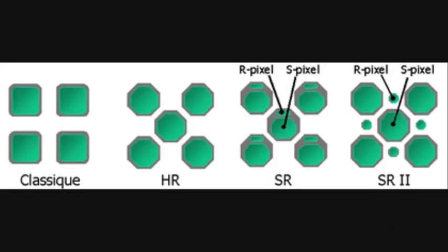The big one would get lots of light. If you had the same amount of light coming in, only a small amount of light would hit the small pixel and a lot of light would hit the big pixel. Meaning that the small pixel would be what they would take for all the details about the bright areas. For example, the stuff which would normally be blown out by the big sensor, like the sky, the flashes, the lights, whatever, the smaller pixel would send that data through because it's only captured a quarter of the amount of that data compared to what the big one would.